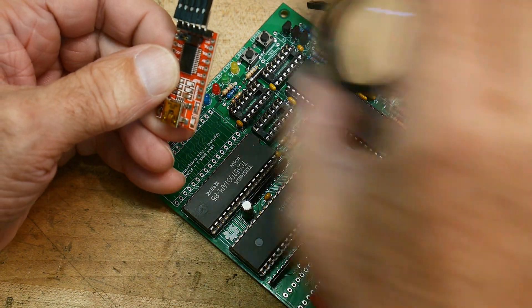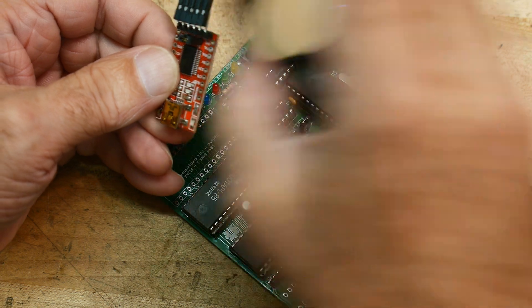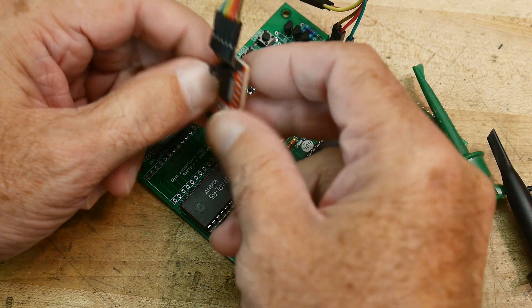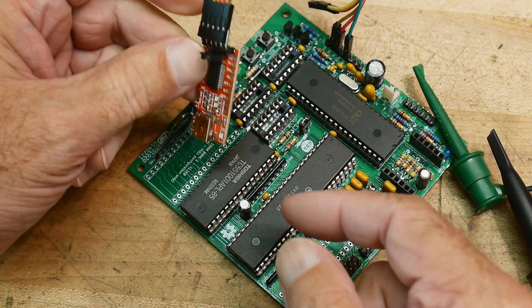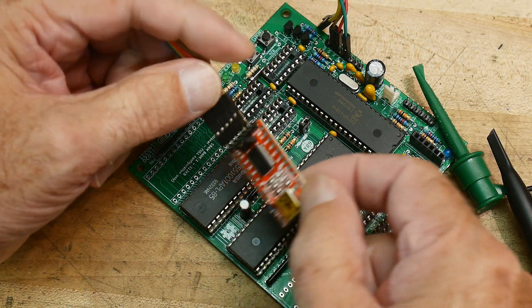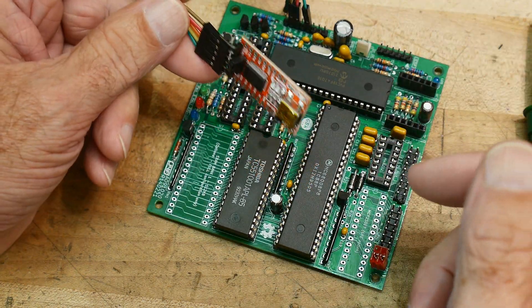So RxD — this is Rx. So Rx to Rx and Tx to Tx works just fine. It's 115k baud, make sure you have that set. Carriage return, everything should be fine. No handshaking.